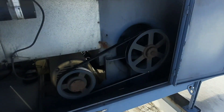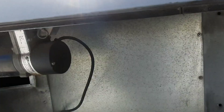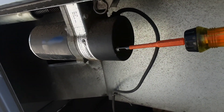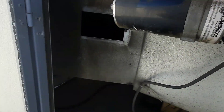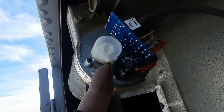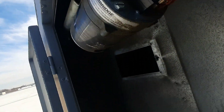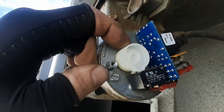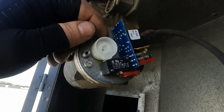Let's verify that my damper is actually moving. Looks like the damper's stuck. Apparently it's making the end switch as long as nobody's bypassed the thing. The damper's got to be open. It's your end switch — it's making prematurely. You can actually adjust from here; that little gear will turn. So when it makes, it closes that switch and it knows the damper's open.